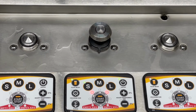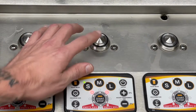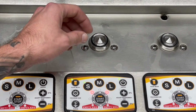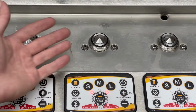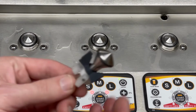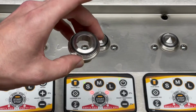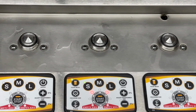So a way to know that something is off with our plunger assembly would be looking at the top of the plunger head here, see how it's sort of a cone. Oftentimes you'll see beer bubbles coming out of there, or sometimes just straight up shooting out. And if you haven't manually opened the valve, which means you reach underneath and push on the solenoid assembly there to sort of realign it. If you do that and it didn't work, and you've replaced, say, the plunger head gasket here on the top, which is a common leak source, as well as the case nut, which houses the plunger assembly, it's sort of a last-ditch effort here. Well, something's got to be a little wrong with the assembly itself.